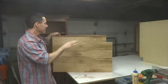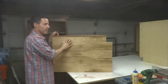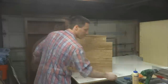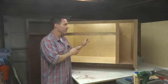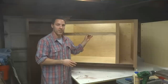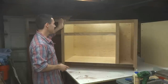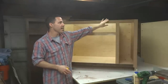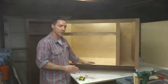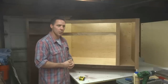I've got all the sides done. Now I'm just going to finish up and do the inside panel that's going to be facing the Lazy Susan cabinet, and then we'll be done. That concludes the construction of the sink-base cabinet with respect to the carcass and the face frame. All that's left to do now is to sand everything smooth and then apply a coat of stain and three coats of polyurethane. I appreciate you watching — thanks very much and we'll see you next time.